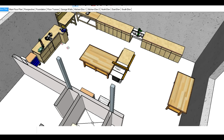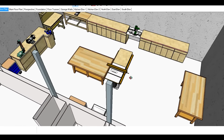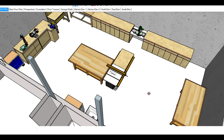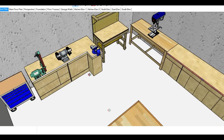Now, that's pretty rare. But sometimes I'll take 16-foot 2x4s and rip them down to 2x2s for soffits and things like that. So it's not common for some people, but for a contractor, it's not uncommon at all to have to rip down really long items. So that basically plants your table saw right in the middle. And that means this part of this bench has to pretty much remain flexible.